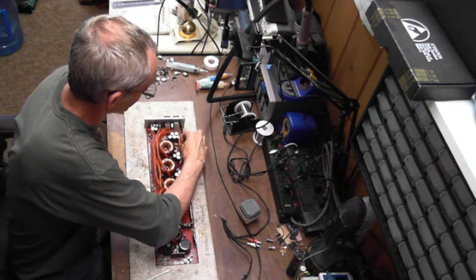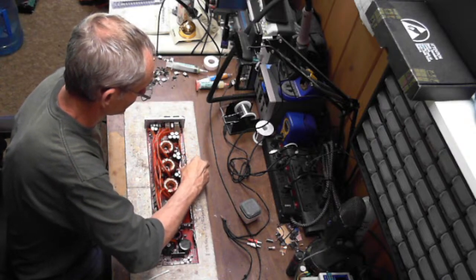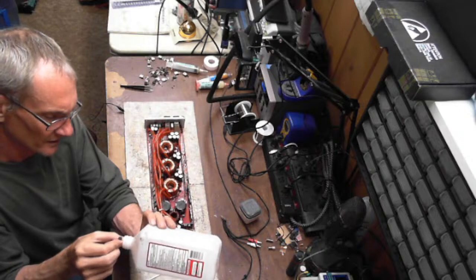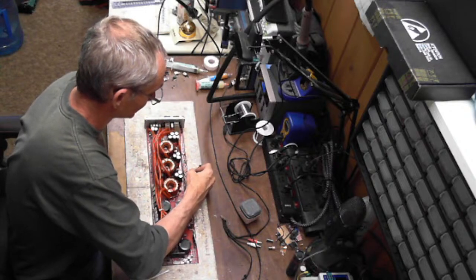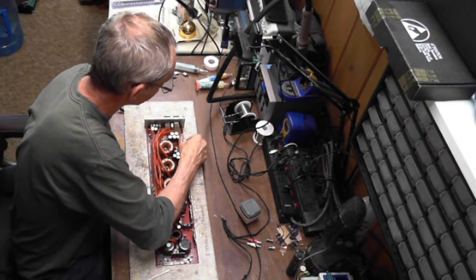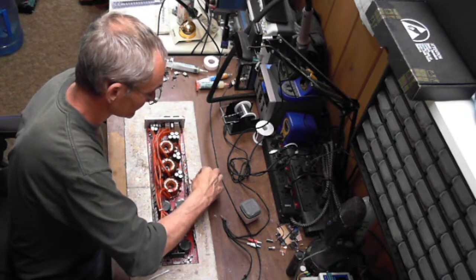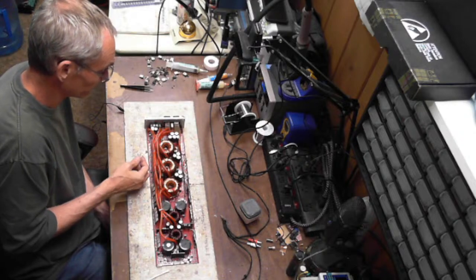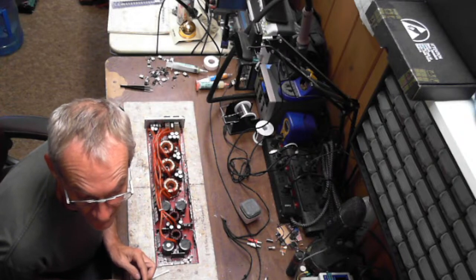Sure are a lot of transistor guts on this board. So, if these were equivalent to the 3205s, what gate resistor value should we see here? So far, I can't see any gate resistors because they're all burned up. The pull down resistors look okay, but I'm trying to find a gate resistor value. Oh yeah, I got some. All right, what are the gate resistors on this?